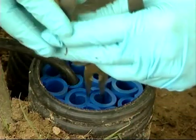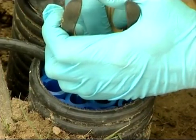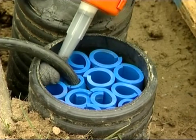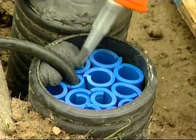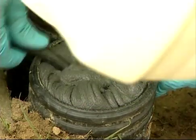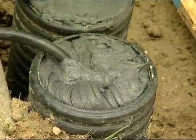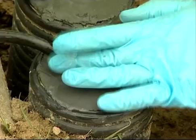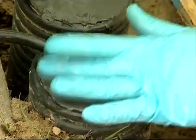Note the use of long-nosed pliers to adjust the sleeves to give a uniform depth of 20 millimeters. The sealant is applied, adhesion is checked, and the sealant is pushed down with the cloth and smoothed off by hand to finish the job.